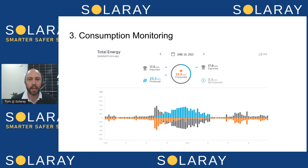This would be a great candidate for adding a Tesla Powerwall battery, which has a capacity of about 13.5 kilowatt hours. If you look at all that electricity — 17.9 kilowatt hours has been exported to the grid — you could store a lot of that in a battery and use it in the evening when the household comes home from work. The other way of managing that would simply be to use more electricity during the daytime.